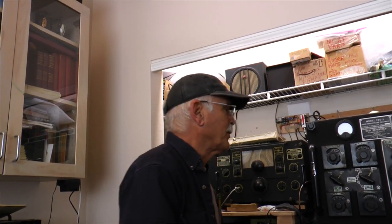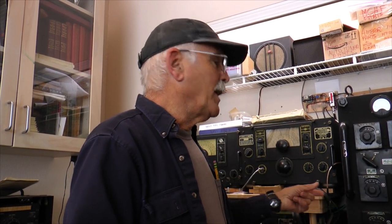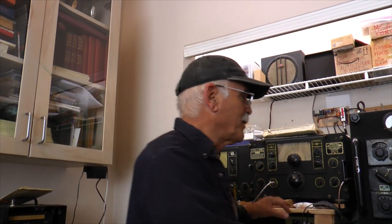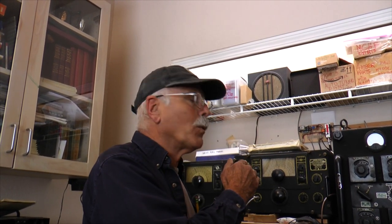Essentially, when you go to AM position, the suppressor grid normally sits at the cathode potential, just to keep secondary emissions from electrons off the plate. But if you bias that suppressor, you can shut the tube off. So you've got the transmitter set up in AM position, the suppressor grid taken off the cathode, the normal position for just creating carrier, and you bias it to run the power way down. That's why it's only 20 watts carrier. But on voice peaks, it'll be back up closer to 80 to 90 watts. That's the way they did it. It's backwards.